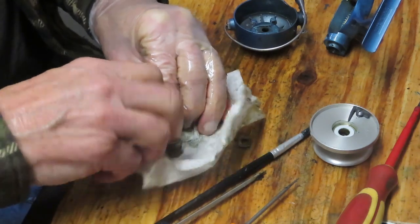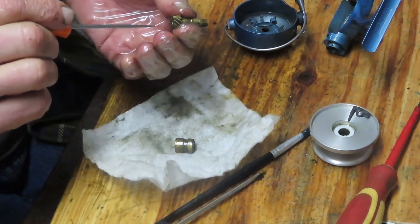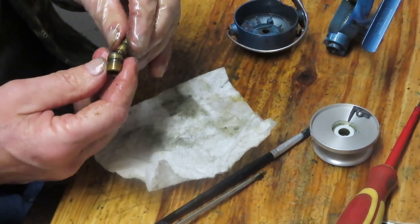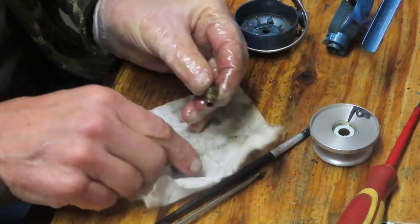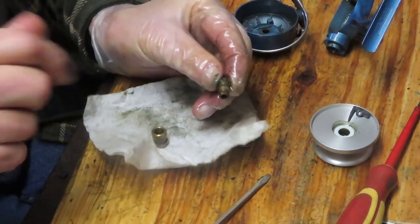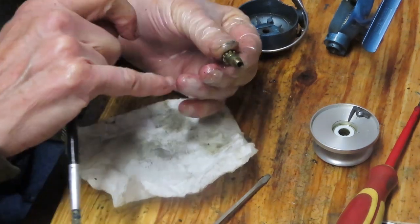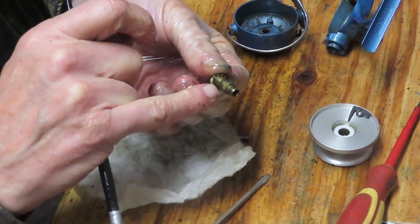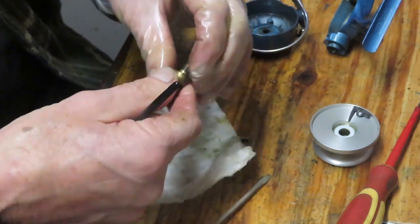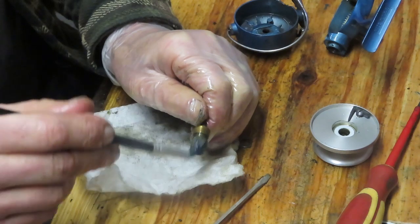Collar came off. Let's try and push something down in there to knock it out. And then we can just reconnect this. You can put a little bit of grease there. It's probably a little old grease in there that let me notice that. If you flip this around and you kind of forgot which way it goes, just look on your pinion gear here. There's a narrow side and a wide side, so just get the corresponding sides as you go to reinstall. And let's go ahead and just grab the brush here.